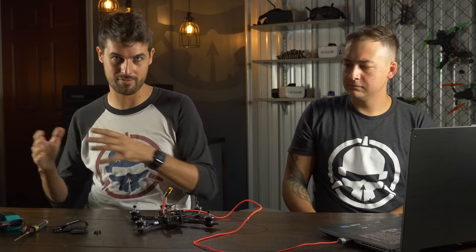The Receiver tab is where you set up everything for the Crossfire receiver on this build. You tell the flight controller how to talk to the receiver, which depends on which receiver you're using — air unit's built-in receiver, FrSky, Ghost, whatever. In this case we've got Crossfire. For these settings to work, you need the correct UART setting already done — we set UART 5 earlier. Now we tell it what language to use: select Serial via UART, and for receiver type select Crossfire, CRSF. Now the flight controller knows to talk over a UART using Crossfire protocol. Hit Save and Reboot.